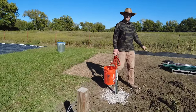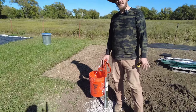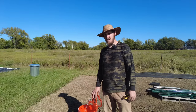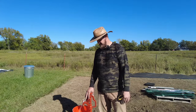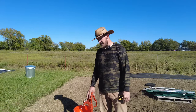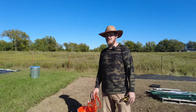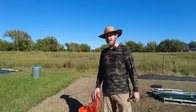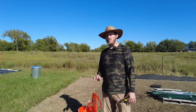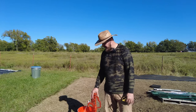Woke up this morning with a micro leak, and the trench was partially flooded, and it was clearly leaking out. It's not the most confidence inspiring to take a giant metal yard hydrant and attach it to plastic PVC bushings. So I think in the future I would recommend getting maybe a metal right angle SharkBite fitting, and then you can connect it right to the PVC. I think it'd be a lot more confidence inspiring than connecting this very heavy metal yard hydrant to plastic.